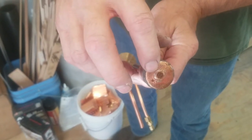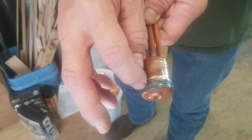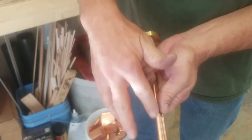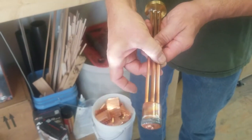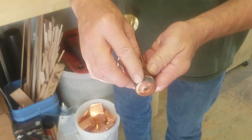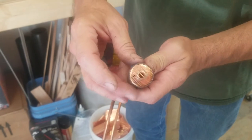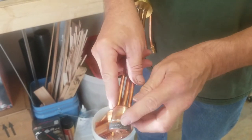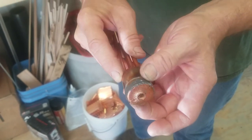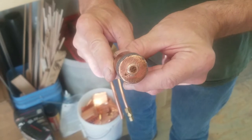On the bottom you'll notice the fuel line has been flared and is soldered to the bottom cap and soldered to the top. The vent side tube runs almost to the bottom and is soldered at the top, open on the bottom; at the top there's a little cut in it, making this a true vent — an overpressure vent so we don't ever get too much pressure in the opposite line going to the gauge. At the bottom there's a little hole drilled through so this chamber will fill with fuel and allow the gauge to read a column of fuel. At the very bottom we have a copper screen formed all the way around. I use JB Weld, which is 100% fuel-proof after fully cured — wait four or five days before putting fuel in it. Everything else is soldered, but JB Weld makes the screen easy to attach since the mesh is so fine you don't want to burn it up soldering.